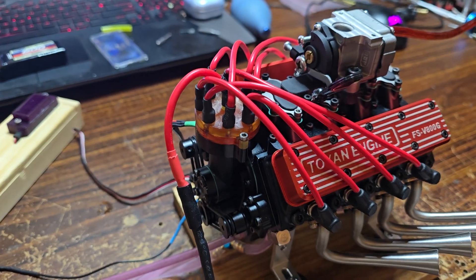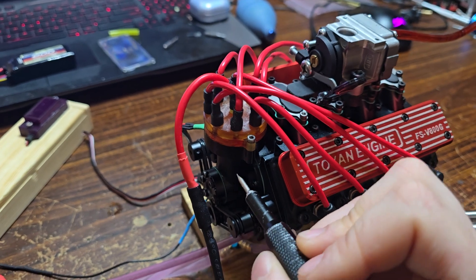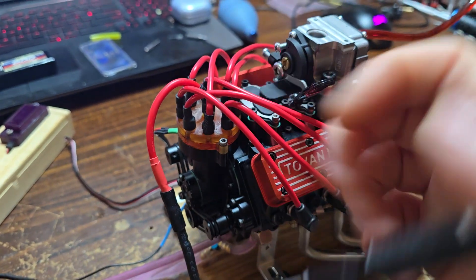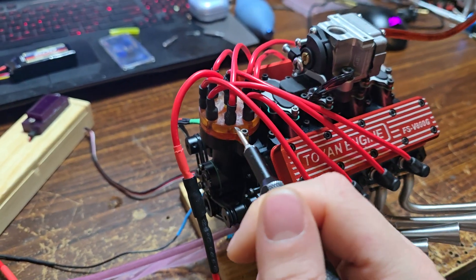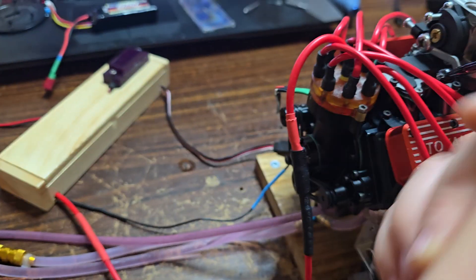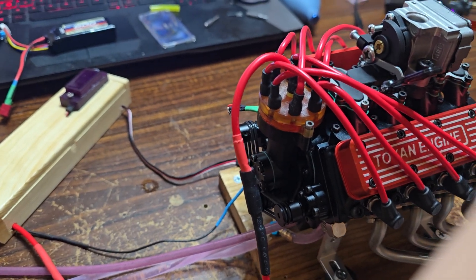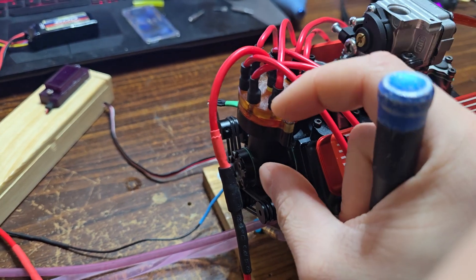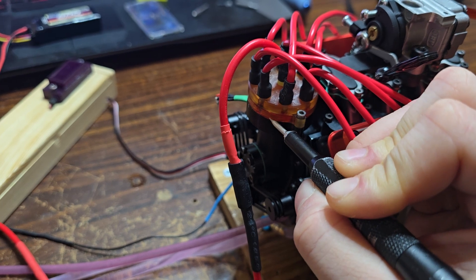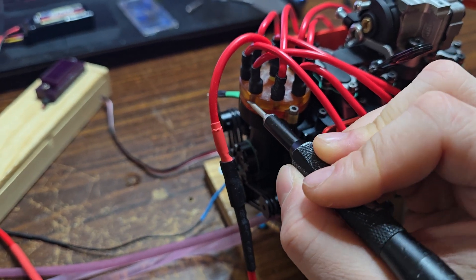The way to fix that: take out your distributor and take it completely apart. You want the rotor that's inside it, and the stem and metal plate it's sitting on. When you look at your cap, you'll see four feet or four circles underneath it — that's pressed on, not glued. Pull the top layer off from the bottom layer, get rid of those four feet, sand those four sides flat so it's flush, and using a single drop of glue on the center, put your rotor back on.